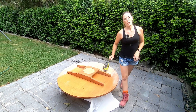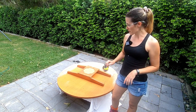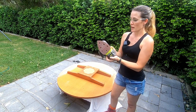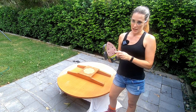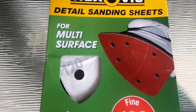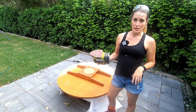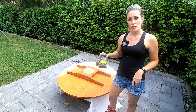While my base is drying, I'm going to come out and sand this table top and underneath so that it all has a consistent finish. To do that I'm using a small Ryobi hand sander that is battery powered, so I'm not tripping over cords. You want to get a coarse sanding pad - I'd recommend getting a 60 grit or 120 so you have either option. It depends on the lacquer and finish previously used on your table. The thicker the lacquer and sometimes the older it is, the coarser the sandpaper you'll need to remove it.